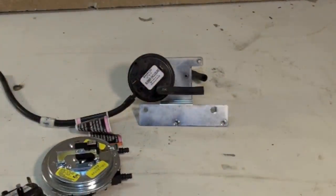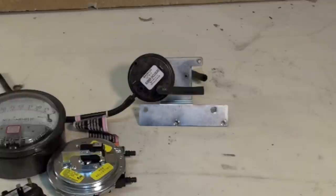That's pretty much pressure switches. They are gauges of how the system is operating — they're telling you if there are problems, they're an overseer, and they will not let the appliance start unless the conditions are right. Make sure the conditions are right and make sure you've found why the pressure switch is not working. If the pressure switch itself is at fault, that's fine — but make sure something else has not caused it to fail.